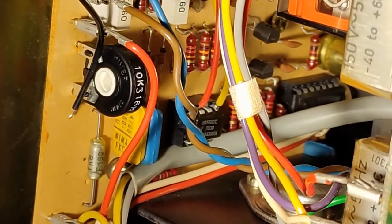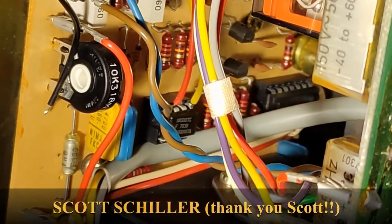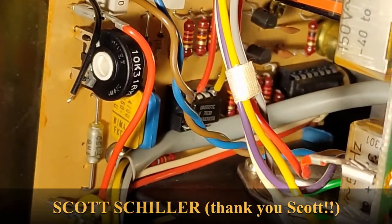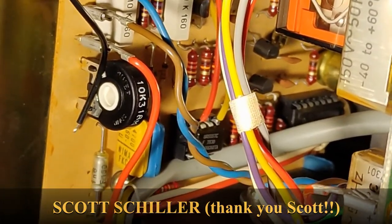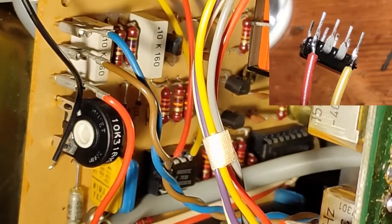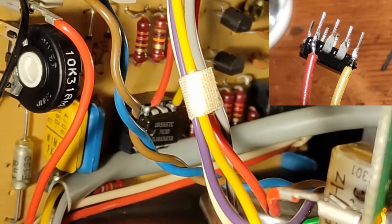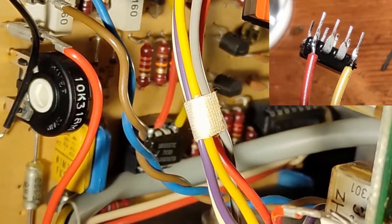This work is based on a YouTube channel. I don't remember the name, but I will put a link later while producing the video. There is a guy who made two videos for making this machine with a varispeed option, and I am convinced to make this modification on my machine too. That's why I soldered these two leads there on the outer pins of the 555.